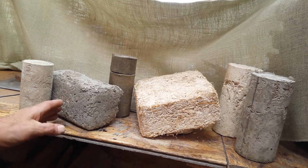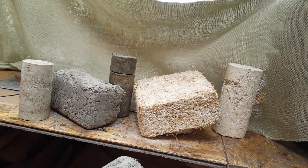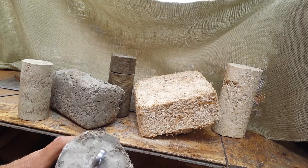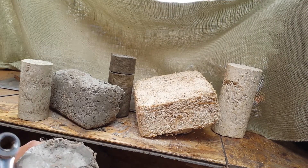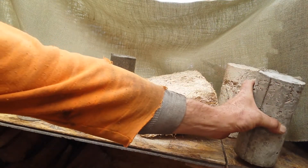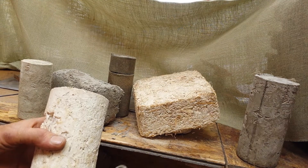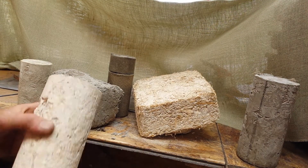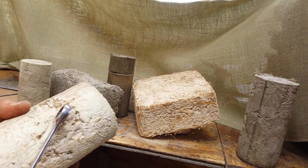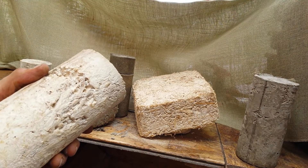Even with the help of the clay binder they put in here, you can step up the mixture a little bit and it'll perform slightly better, but it's still not going to bind to the organic material. This is Portland; this is a lime with bentonite in it — same basic property, a little more solid, but still not capable of fully binding to the fiber. If it's locked into a wall it'd be just fine — no issue at all.